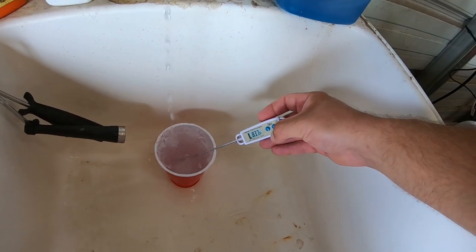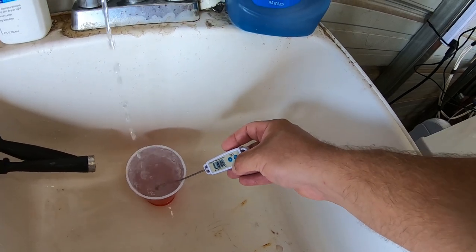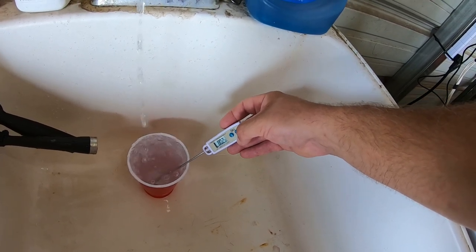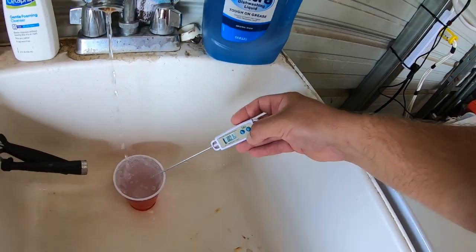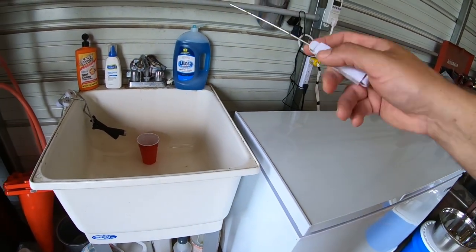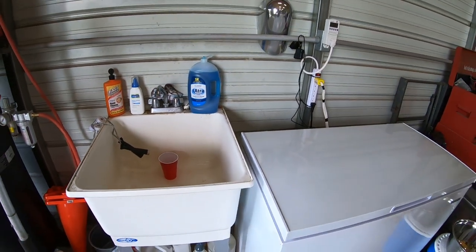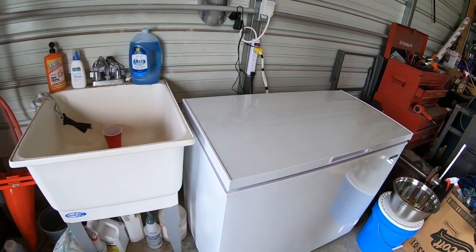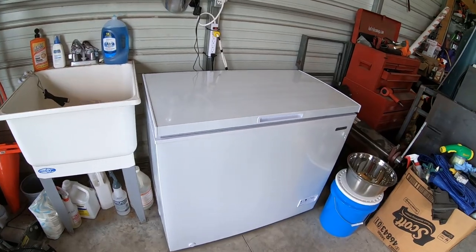I have been checking this water for the last couple of days while trickling, and it is making a lot of difference. It's the middle of the day right now, very hot, and the incoming water temp is staying at 80 degrees — actually dropping, might go into the 70s. 80 on the dot. For the last 24 hours it's staying anywhere from 78 to 80. Keep in mind, when I let the water sit still baking in that pipe outside in the sun, it's been coming in up to 99 degrees. This is just a start — I understand we want to try to get water down to 40 degrees or so.